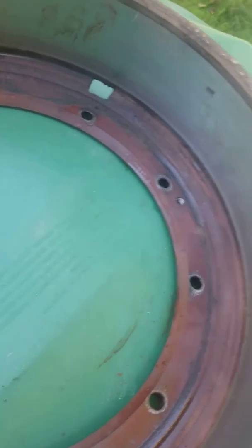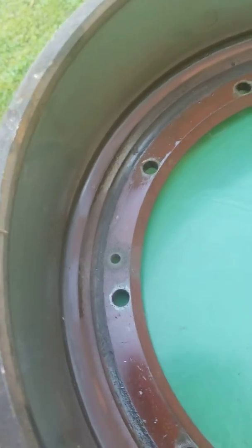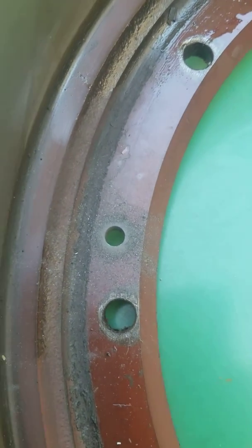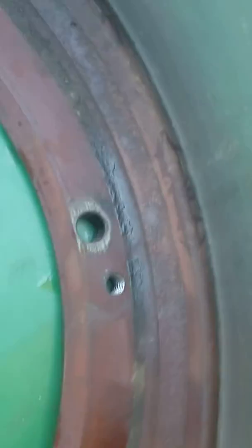After I got the whole assembly off, I took all the nuts and washers off of it. Then I thought it was a good idea to bring it up to the garage and drill it for 17/64ths, and then what I ended up doing was threading them 5/16-18.